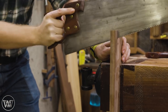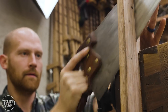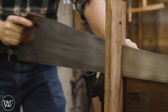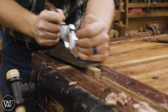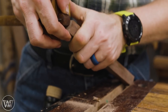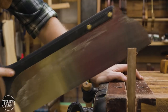In order to get this out of a three-quarter inch board, I need to cut it down into a stick that's about one inch by three-quarter inch, and then resaw that stick down into a stick that's about a quarter inch thick by one inch. First I rip it down into that stick at about one inch by three-quarter inch, then plane it down smooth so I have a reference surface to mark things off of. Then I use the marking gauge to put a line around the board a quarter inch in from the outside face.